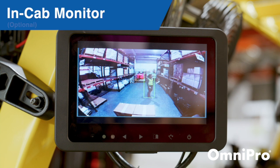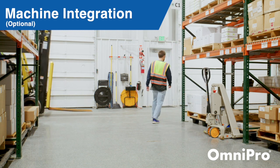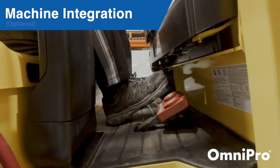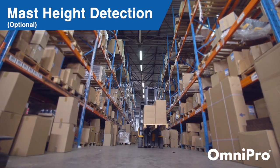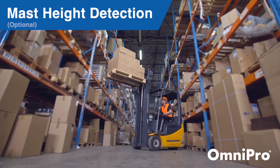OmniPro does not require a monitor to operate, but it is available as an option. Other options include machine integration, which slows the vehicle by deactivating the accelerator pedal, and mast height detection, which deactivates the throttle when the mast is raised past a preset height.